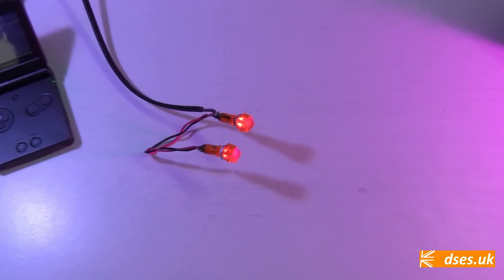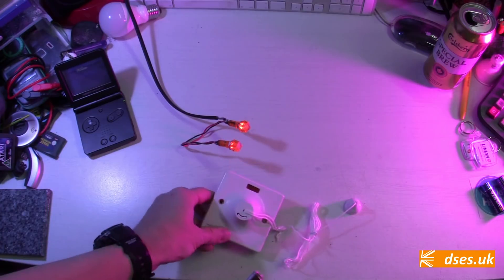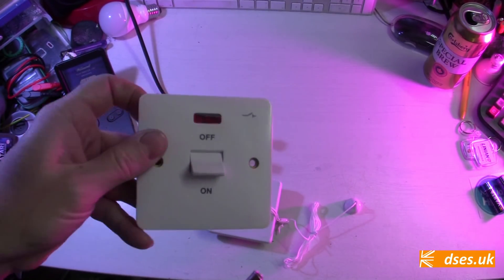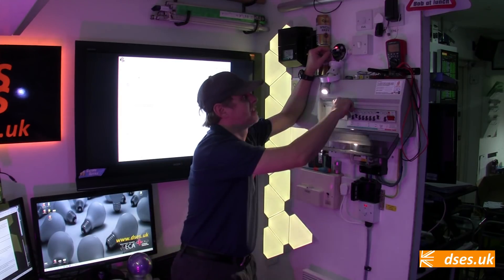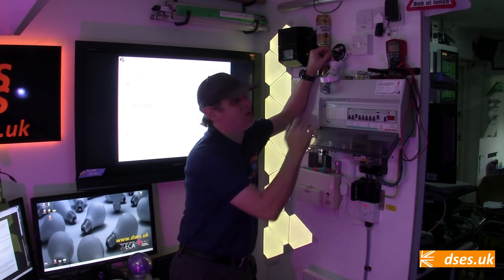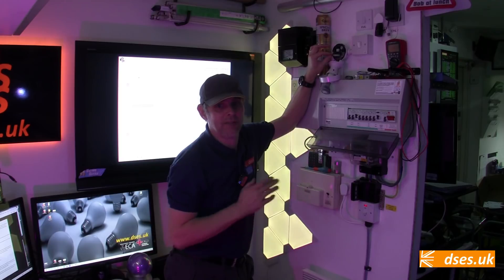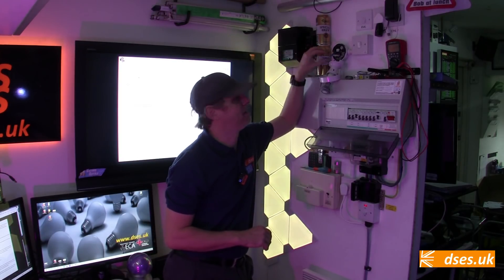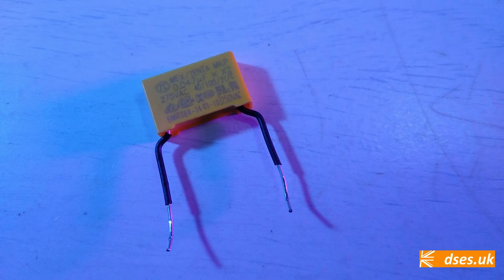Personally, I've never seen it happen. These things are often employed as continuous power indicators for appliances switched on 24/7 — before LEDs, neons were commonplace on fridges and freezers needing visual indication over years. You still find neons on electric showers and cooker and shower isolators, left on day and night with no ill effects. Remember too that the neon will only be at full brightness when the light is itself switched on, so it's not running at full capacity 24/7 in this application. I have no qualms about using a neon here as they're cheap, easy to obtain, and can be bought pre-wired.